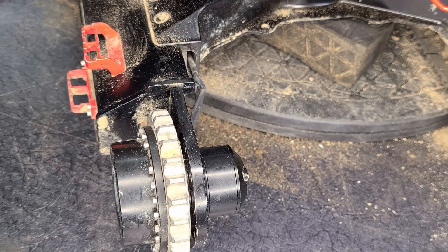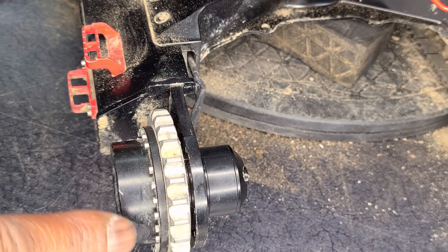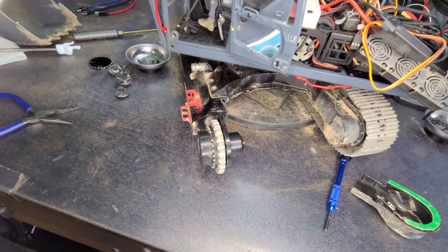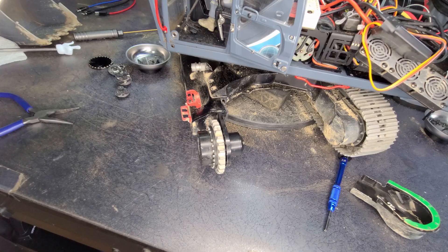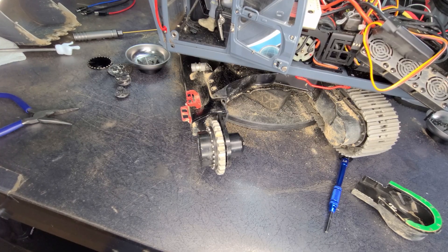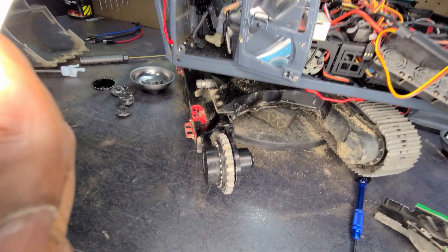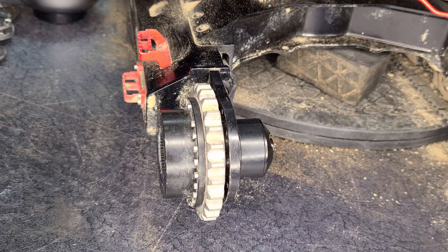I'm good to go. Now I will reassemble all these gears and try it once more. That was a good thing for you guys to see — the three wires that plug from the ESC electronic speed controller into the excavator have to be in proper phase for the motor to work well and at its maximum efficiency. Now I will start reassembling this motor.